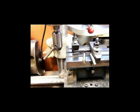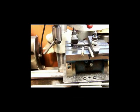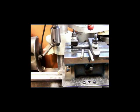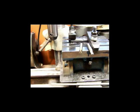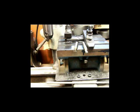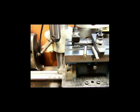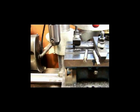Yesterday I did this piece as a test after I finished that base holding rig. I put the clamps on and it's a half-inch cold-rolled piece, and I ran the end mill through it to make a slot, then ran the dovetail through to make a groove — that holds the front side for a rifle.